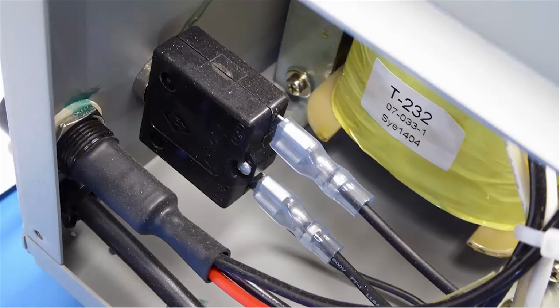The AC input area has a circuit breaker. The chassis ground is there, I did check it. It's got a lock washer on, everything looks good. And the transformer fuse and all connections seem to be nicely covered. Also, most of the hardware has the green Loctite type material on it to prevent working loose.